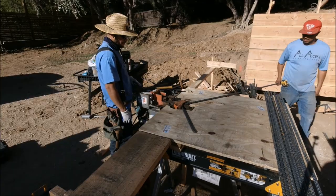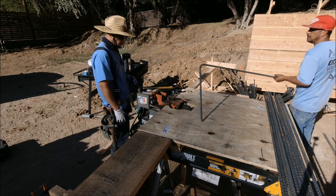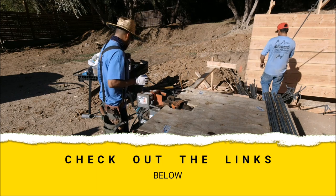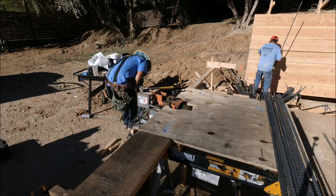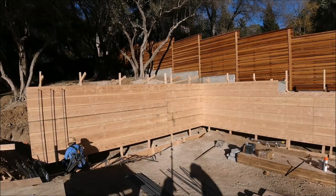The candy canes go from the keyway up into the retaining wall itself about two feet. We also ended up cutting 85 L's, sometimes called verticals. We always test our first vertical and make any adjustments if needed before moving on to install.